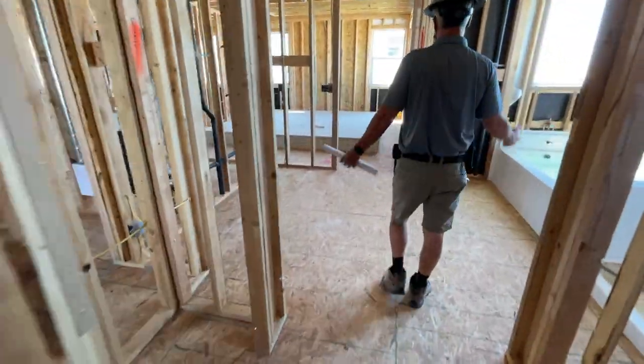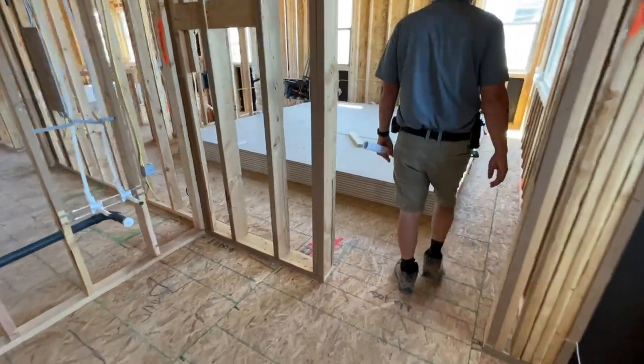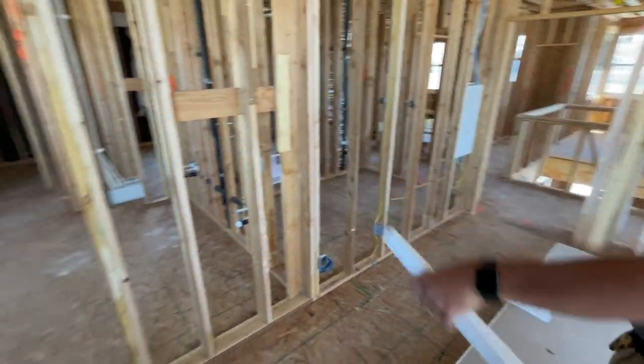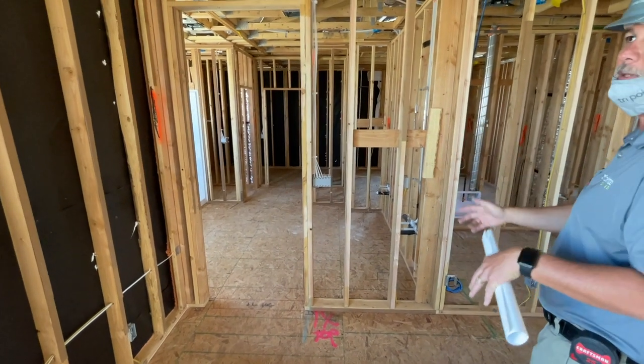Now that it's all closed, we've all been through it once. The pink is mine. The blue was a different crew. The orange was the framing foreman. And now all we're doing is waiting today and tomorrow to do water tests, that's why there's tub water in the tubs, to make sure nothing leaks in the house. It'll sit in the tubs for a couple days.